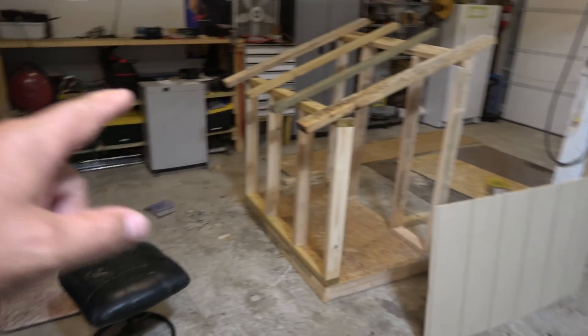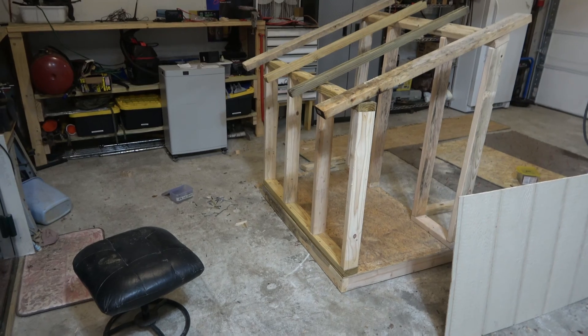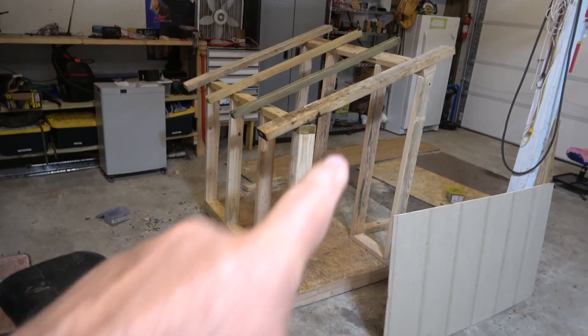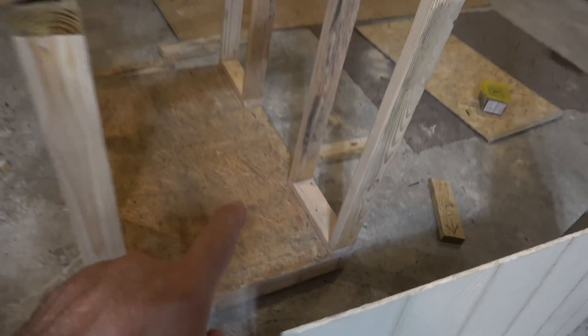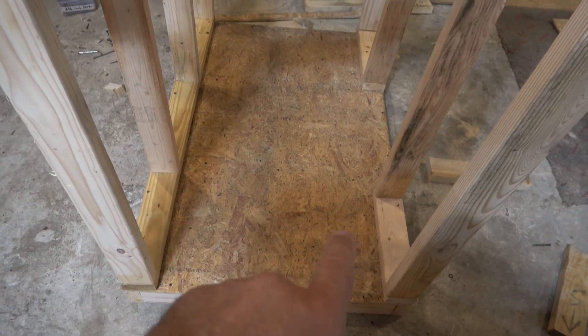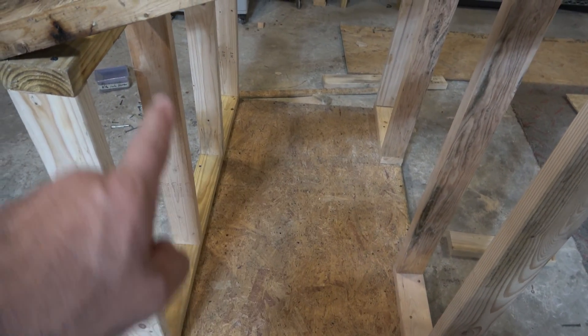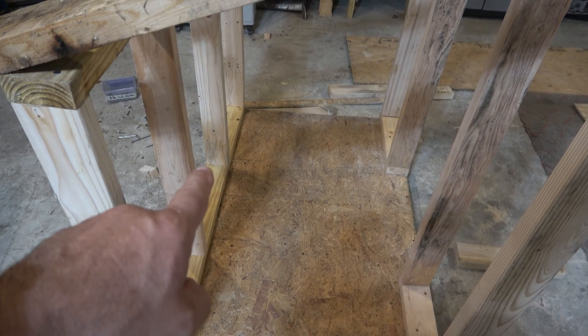The battery over there, which I did a video on before, that's a 24 volt — I think it's 5.7 kilowatt hours. I'm going to put two of them in here eventually. So my idea here is there'll be one here for right now, and eventually I'll put another one there. They're going to get linked to this back wall here, and we'll have the charge controller and the inverter box there.